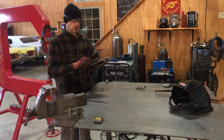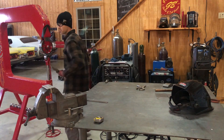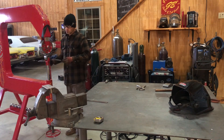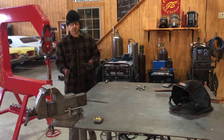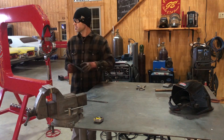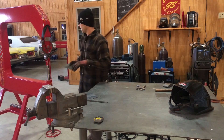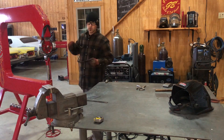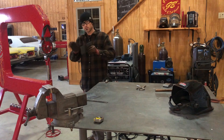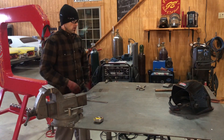The biggest thing with the English wheel and the finishing hammer — you've got to make sure you hold your material flat as you're coming in. If you start pulling it down or going at different angles, it will change your panel. The English wheel is nice for fenders too, as is the planishing hammer. If you're doing a fender, you can hammer and dolly it and smooth it out somewhat, get it to this stage, run your weld, and kind of blend outward. If it's a lower fender or top, you can massage it out so it just blends all in and you have a good panel.